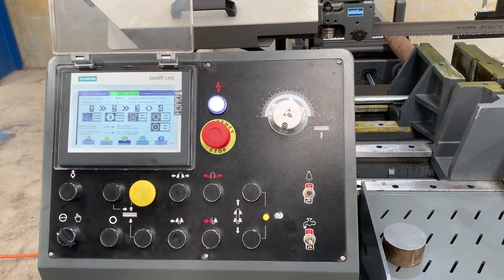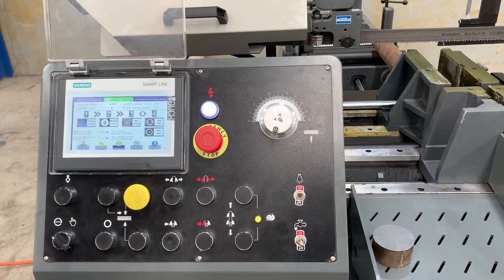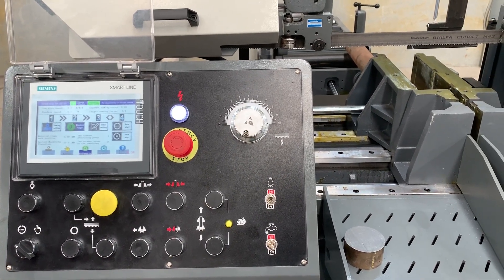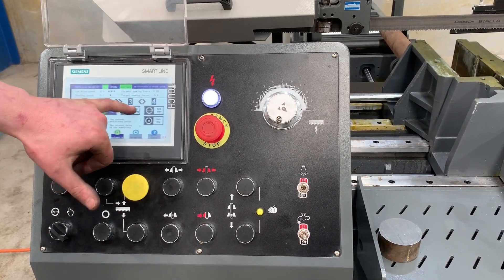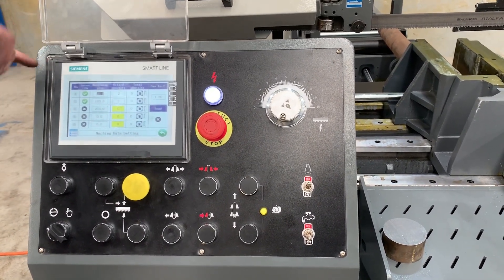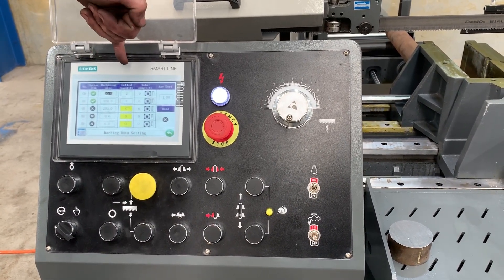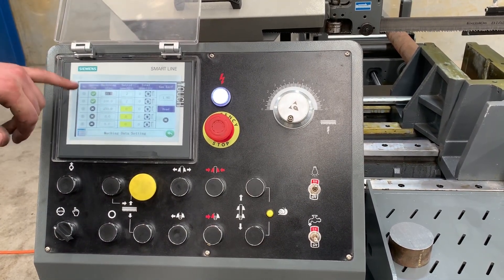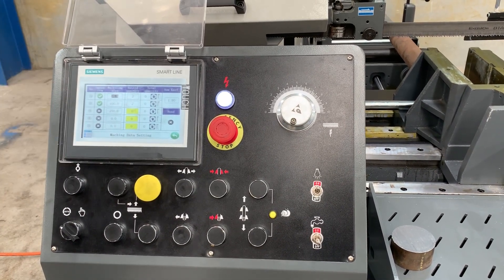Next we origin the machine, which will preposition each axis to its own home position. Once it's turned green, that indicates it's in the origin position and it's ready to start. Lastly we go to data setting where we have access to the lengths and quantities we want to cut — the length, the quantity of that piece, and a total quantity that gets filled as you cut. I've only got two rows ticked so we're cutting two different pieces, four pieces total.